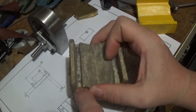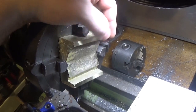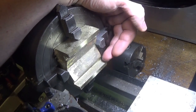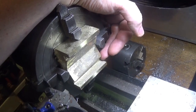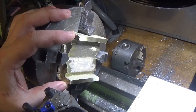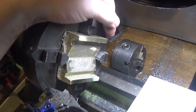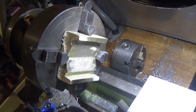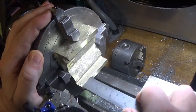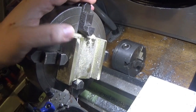These grooves need to be cleaned out to 10 millimeters — there's a fair bit to take out of them really. This had a bit of a rock in it so the first operation was to take this top edge down a bit. There's plenty of oversize on it and this groove really wants to clean up to 12 millimeters. I've gone through till that's cleaned up — have a look with the ruler, that's just on 13 millimeters and it seems to be pretty uniform, so I might take another millimeter off.